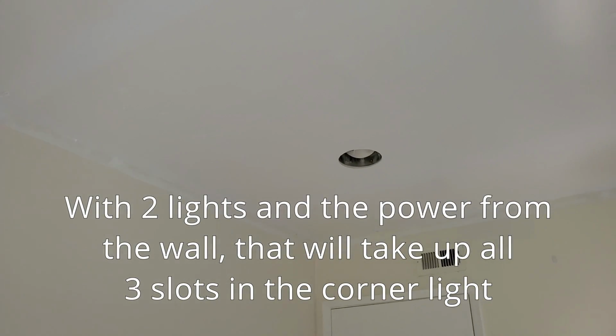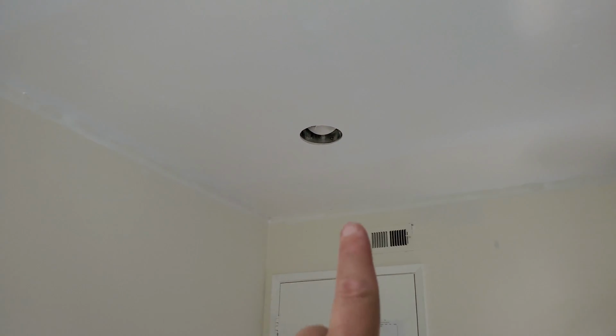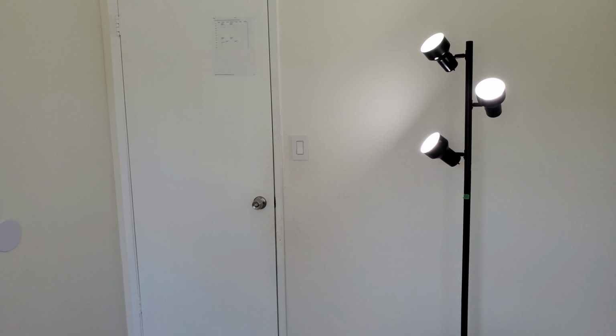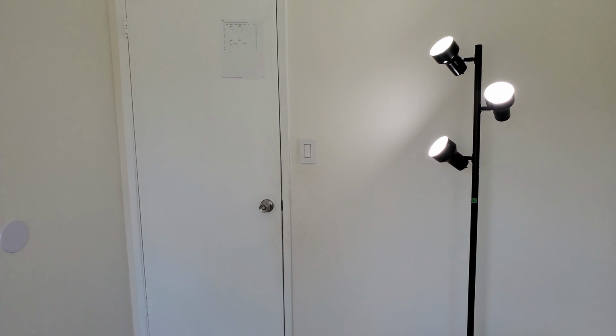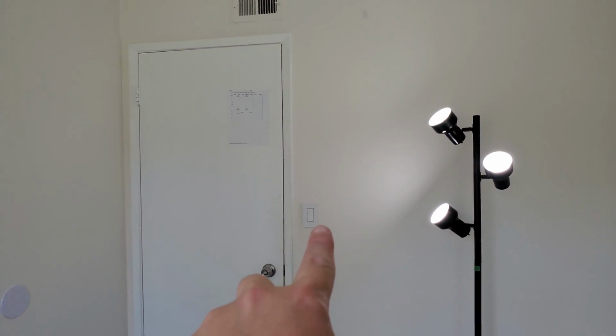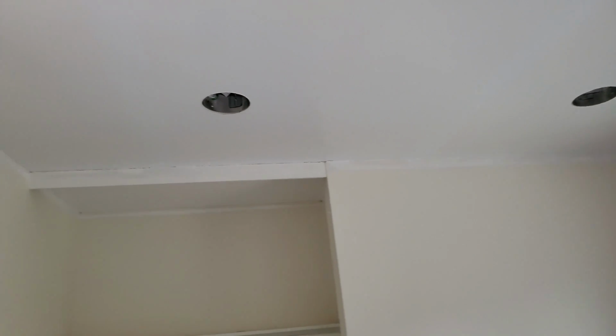So again, I'm just prepping everything prior to going into the attic, and then I'm going to connect everything to that one. And then here I'm actually talking to a drywall guy, seeing when he could possibly come over here, and I want to turn this one switch box into a dual gang box so that I can have 2 different switches for not only the light but for the fan that I will also be routing the power for down the same way. And we'll just connect it over here to the two gang. All right, now there ain't nothing to it but to do it. So let's go ahead and fix this paint while the attic is still cooling off.